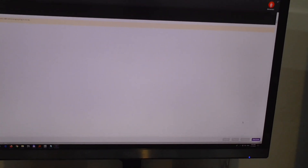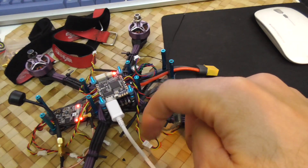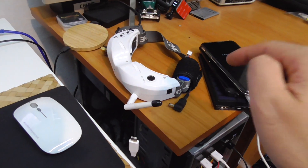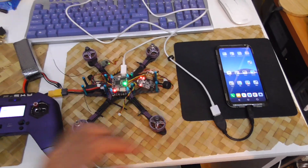So in this case, if this one is not working, then you should try to use a smartphone and connect that one to the drone via the USB cable, and use BLHeli configurator on the phone itself. It's an Android phone and there is an Android app for that. Now the drone is connected to the phone.